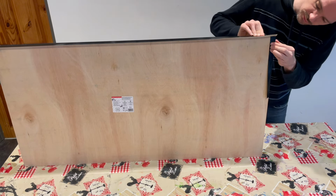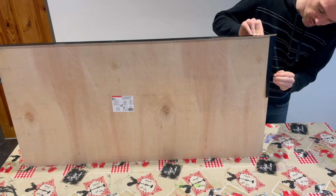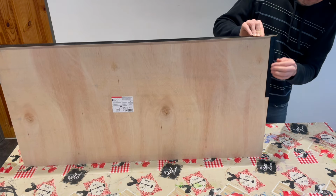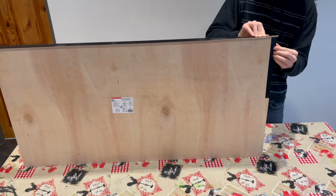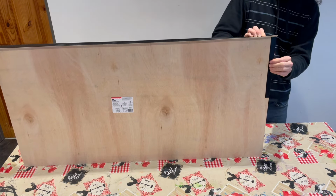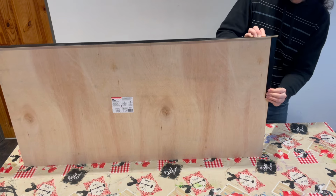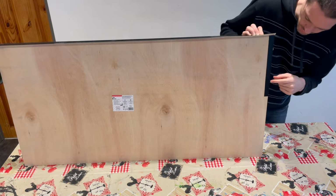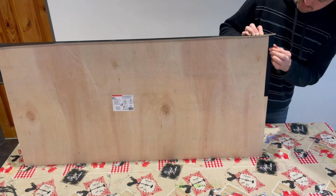What I'm trying not to do is get creases in it, because creases then become a weak point for the textured paint. I will be texturing this board with textured paint, which I'm going to mix up using emulsion and sand. We'll do that in the next video. I'll show you how to do that, and that will cover the kind of ridge between this and this. It'll look really good.